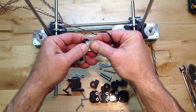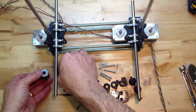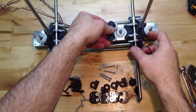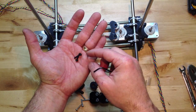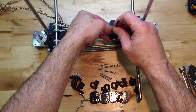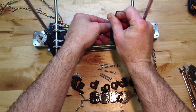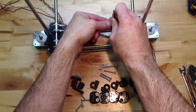So we're going to put two — one on and another one. Same thing here. Now these go on with two M3 screws, which means three millimeter, and I believe these are 16 millimeter. We're using the motor as the mount here. I've never seen this done before, but it's kind of a way to economize parts — very structurally sound. Instead of making plastic parts that float out in the middle, we're just going to use what we have here. This is a very minimalist design.